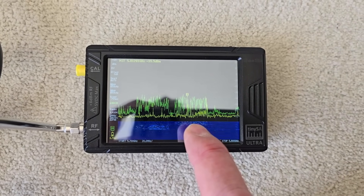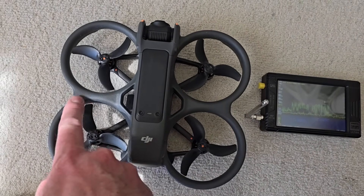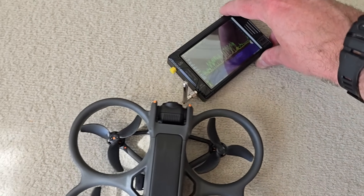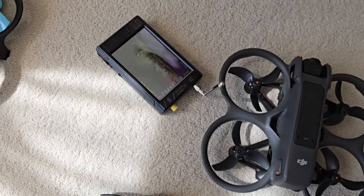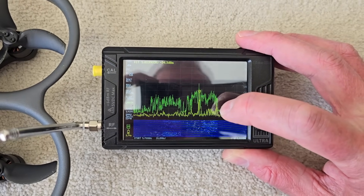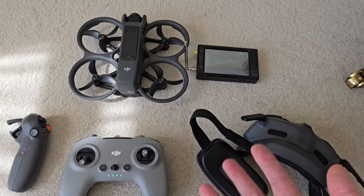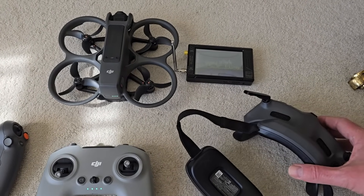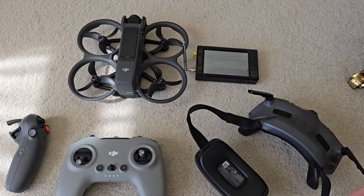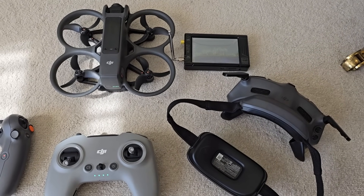You can see this has moved over this side. The drones normally have the antennas kind of around here, I think. If you move this around, you can get an idea of where the strongest signal comes from. This is not super scientific, but it gives you an idea. This green line at the top is actually our peak hold. The way these drones generally work is when you first turn them on and you're not armed, it runs in a very low power mode so it doesn't overheat the transmitter and doesn't cause interference. It's also a good way of not wasting loads of energy whilst it's sitting there.